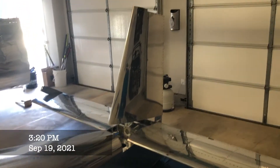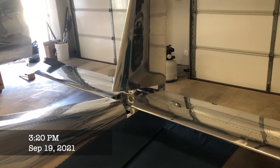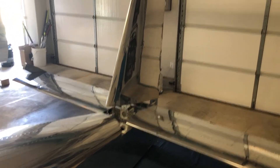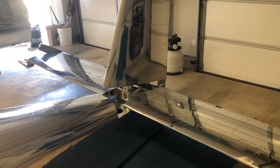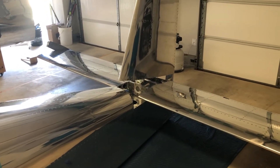As you know, this kit was purchased by a friend who started building and then decided that the RV-10 wasn't right for him. So I spent the whole day today going through pretty much everything he'd done up to this point, confirming use of the right nuts, the right bolts, the right torque specs, and the right alignments on everything.